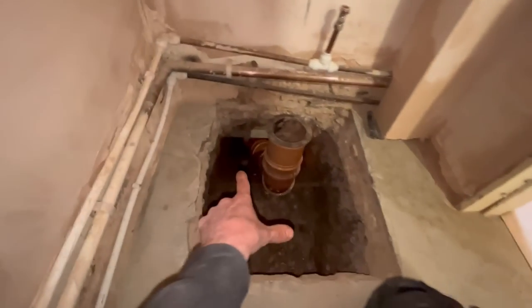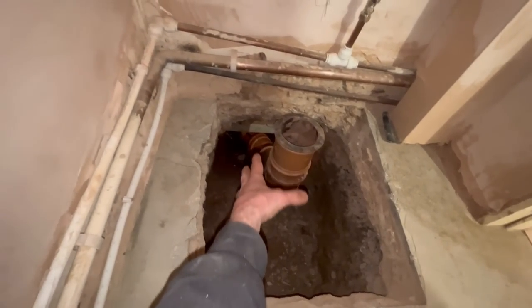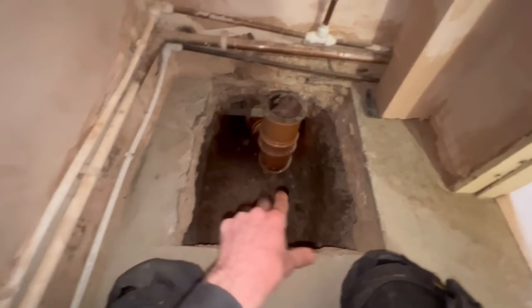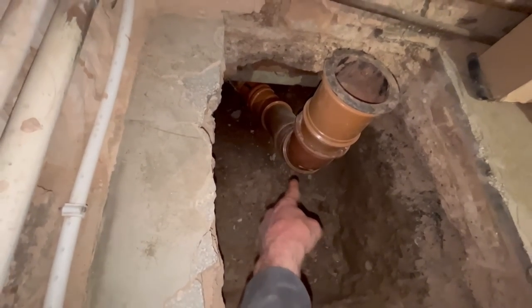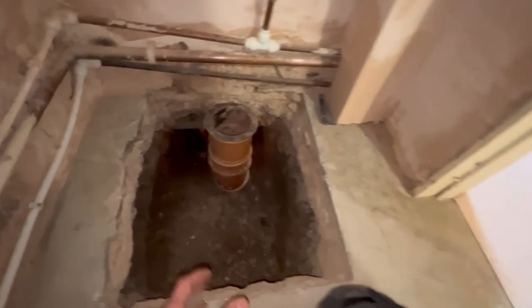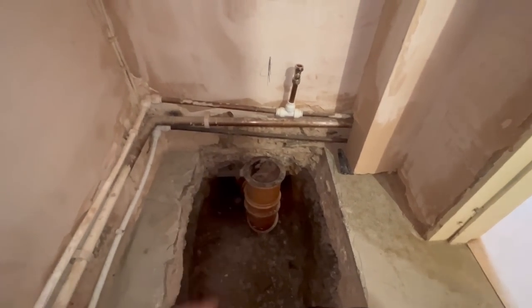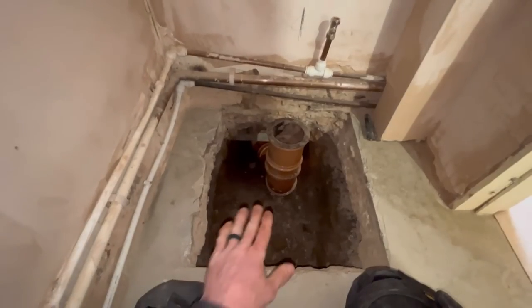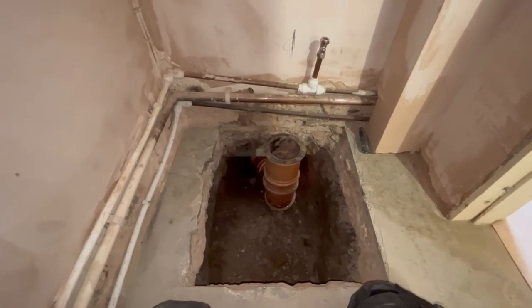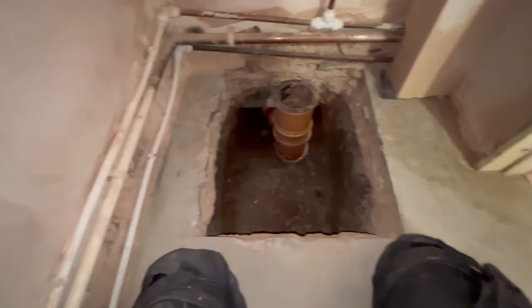And then we'll put pea gravel under there to support the pipe, and then we'll just start to backfill, tamp it all in. When we put some backfill in here, I'll then put some gravel underneath the pipe. And then as we build it up, I'll put some pea gravel over the top and we'll just keep working ourselves up and building it, tamping it with the old little elephant's foot, then build up to concrete level. That's ending up a nice, neat line there where the tiles were.